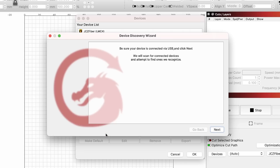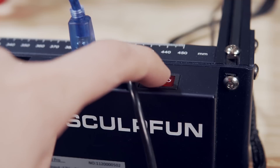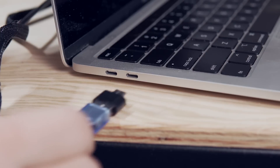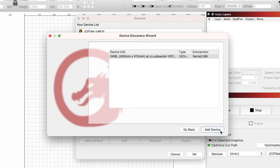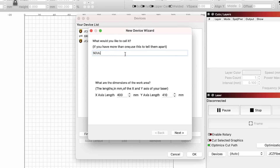Clicking on the Find My Laser button will open a window that will scan your computer to detect the S30. Click on Next to begin scanning. If the S30 is not found, make sure you install the CH340 driver, that your machine is powered on and plugged in with USB. If it's still not found, try a different USB cable and port on your computer. What we should see when we click Next is our laser listed. For the S30, we can see that it found a GRBL machine with a work area of 400x410mm that is a G-code type connected over USB. Next, click Add Device. We want to name our laser something easy to remember. For simplicity, I will name it SculptFun S30.